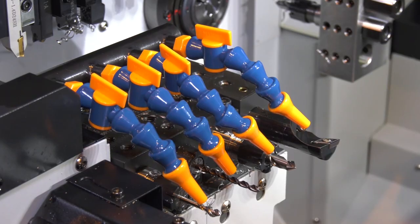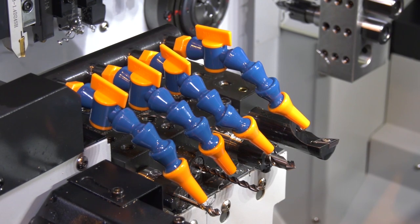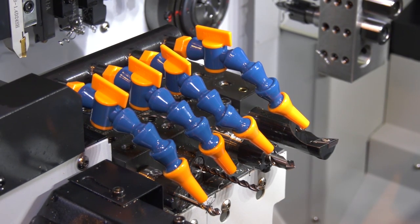This machine does not only run with neat oil — it can also be used with soluble oil. Why is this? Again it goes back to Tornos trying to be flexible — if you can run with mineral oil, great; if you can run with water-based cooling on certain products, then that's great too.